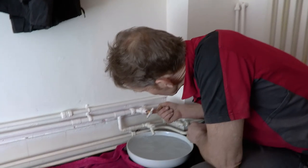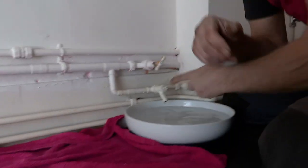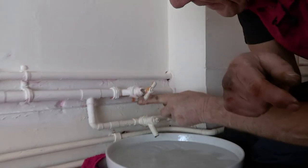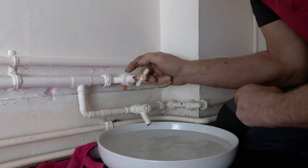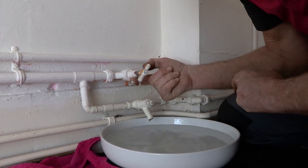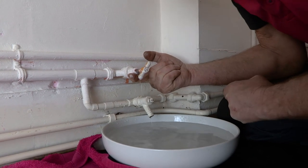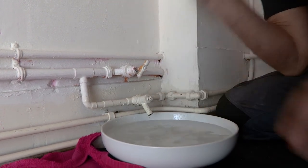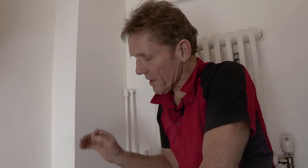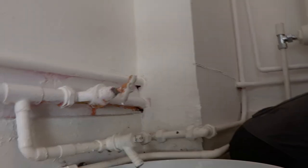The first thing you've got to know is where that water's coming from. If you have a look down here - you might think it's coming from there, because that's where the water's running from, so you think it's leaking around there. But in actual fact, if you put your finger on here you can stop the flow, and you see it's not actually coming from there, it's coming from here. It's always useful in plumbing to have a good look - don't assume anything.